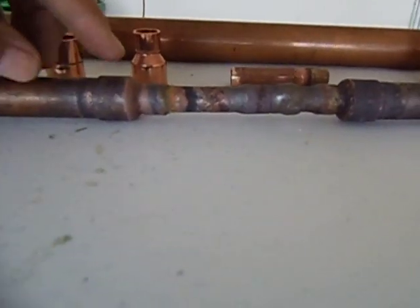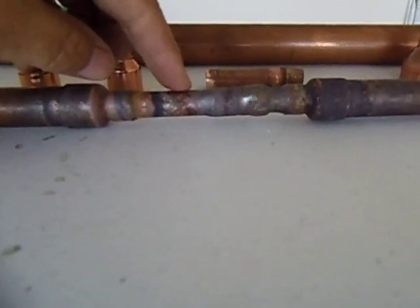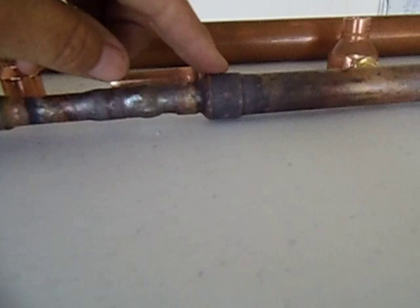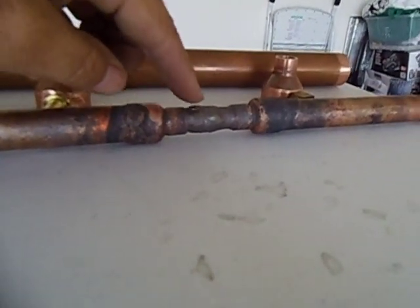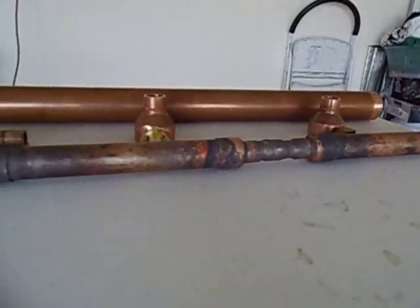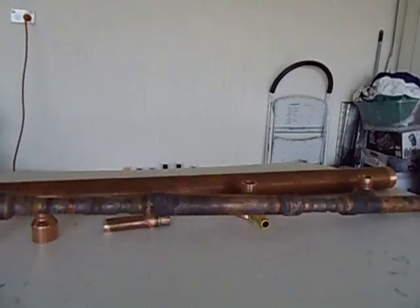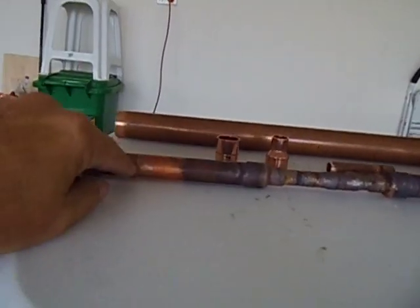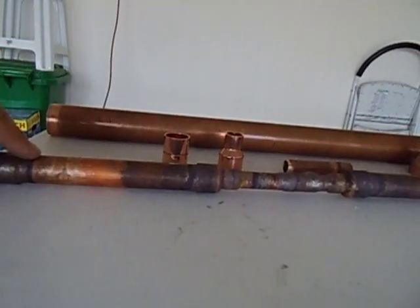Or 3.25 inch. And I've got another reducer — it goes into 1.5 inch again. And another reducer and it goes into 20mm. Another reducer, 1.5 inch, another reducer, 20mm. And the reason for that is, so when the pipe is at a slight angle, it gives the vapours that go into these 20mm sections more time to condensate.